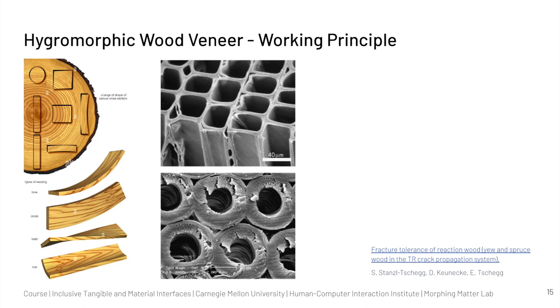That's all because the wood is getting swollen in a higher moisture environment. And arguably, if you pay attention, this is something woodcraft folks know very well, because they have to work with the fiber direction of the wood in order to prevent or take advantage of those swelling behaviors. So if it's a piece of wood you cut in a different orientation, when the moisture condition in the environment increases, they actually morph in a different way. These are all to do with the fiber orientation and the relative cuts you are doing.